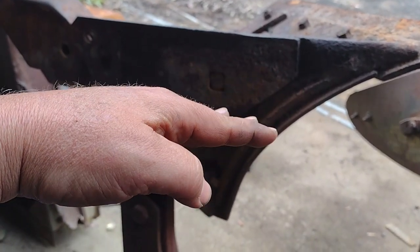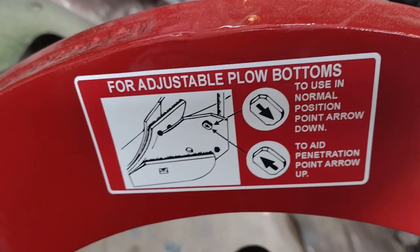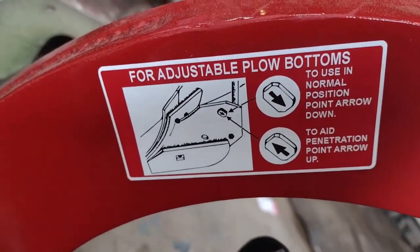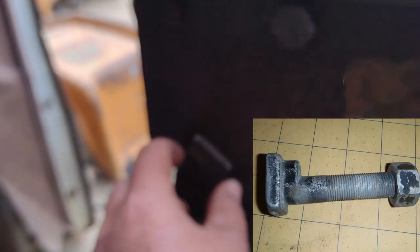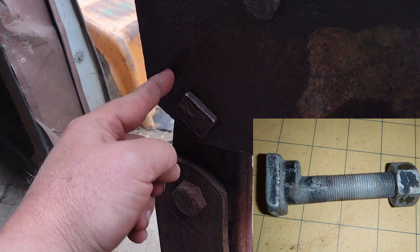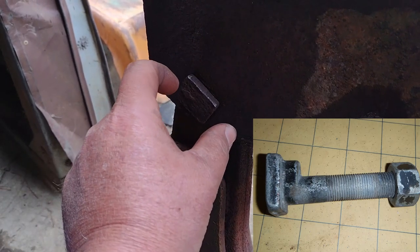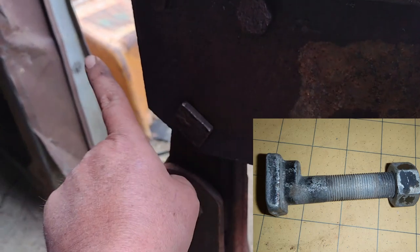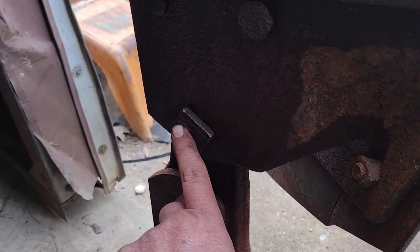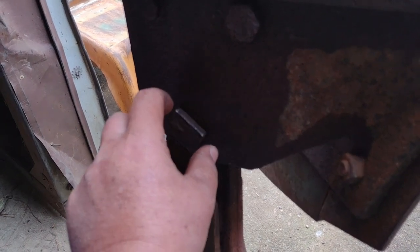You put the arrow in the down position for normal, and in the up position for more penetration. There's a little cam bolt — I'll put a picture of it in the description. The bolt is on this side and there's a little nub that sticks out, and there's an oval slot. To set it to normal position, the arrow would be pointing down when the plow is turned upright.